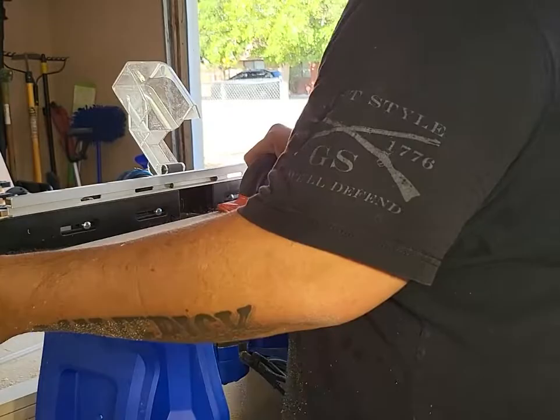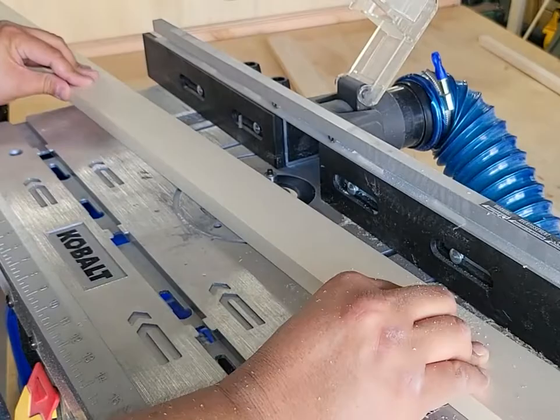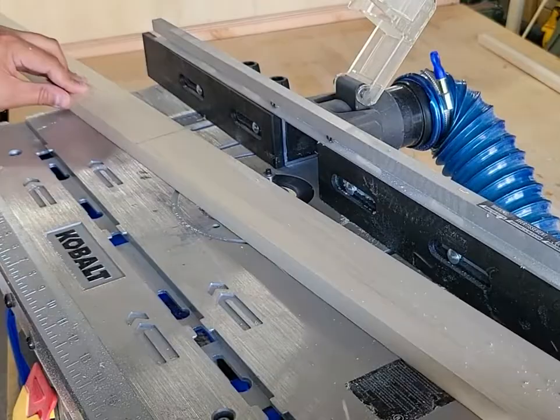After that I set up my router to do a half-inch round over on the inside edges of my trim. It was originally my intention to do a quarter-inch round over on the outside edge, but when I cut the reliefs on the back to accommodate for the proud drywall I accidentally cut one on the wrong side and ended up just doing the half-inch round over on both the inside and outside edges. It was a deviation from the original plan, but both my wife and I actually liked the way it looked — that's how you take a screw-up and make it work for you.